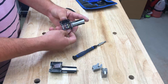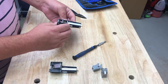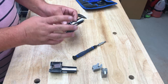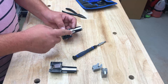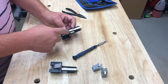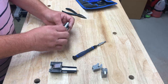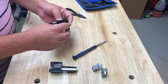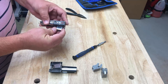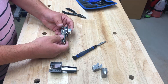The retract is now mostly assembled. I haven't tightened these because getting the spacers back together is kind of finicky. What I'm going to do before I fully tighten these down is put some fresh Loctite on each one of these. That way, when I fully set everything, everything will squeeze nice together and I don't have to worry about it vibrating or coming apart in the future. As you can see, I now have the proper movement — and it's just those three parts you have to replace.